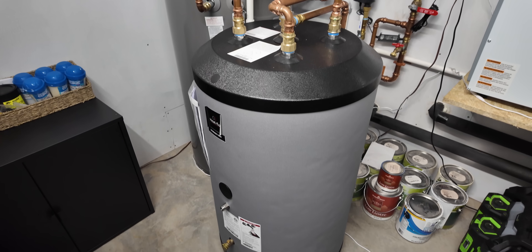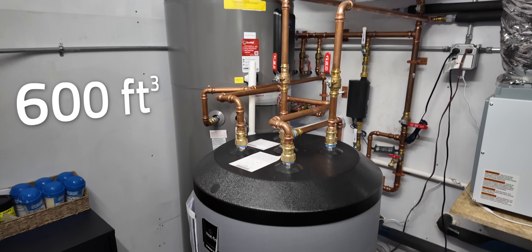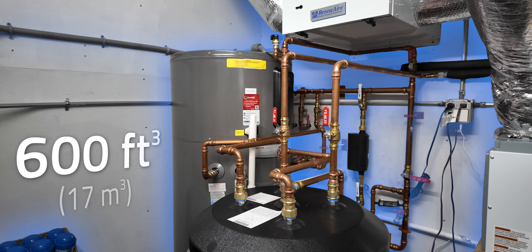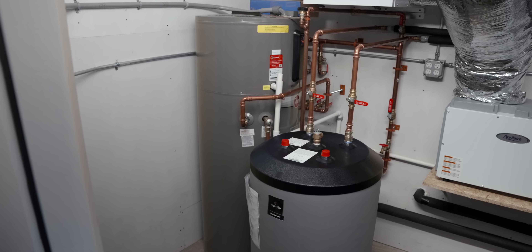This is very noticeable in my setup. My mechanical room is technically too small — you need about 700 cubic feet, but my mechanical room is only about 600 cubic feet, and that doesn't account for all the equipment inside taking up space, so it's probably closer to 450 or 500 cubic feet. When we first moved into the house, the mechanical room felt like a meat locker when you'd open the door — in other words, it was really cold. There are ways to vent the water heater to alleviate this issue, but we opted not to do that, at least not yet.